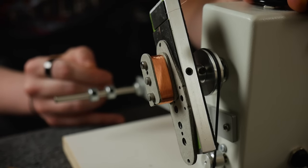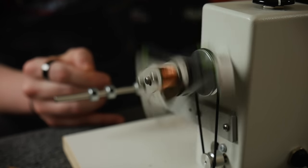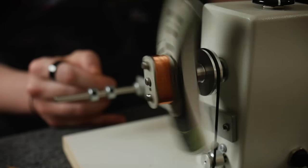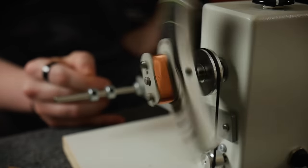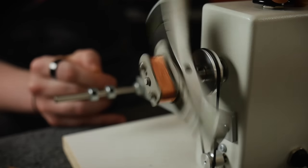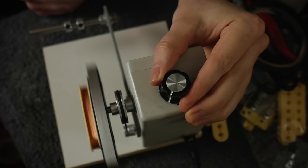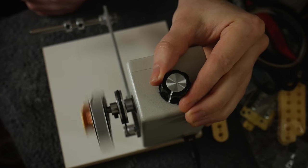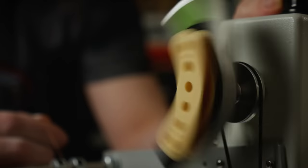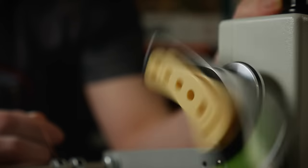There's a lot to be said for doing it the way that it used to be done, as it's those tiny, immeasurable inconsistencies that really resonate with people. When I'm winding pickups and I want different models to sound different, I'm not just changing the number of turns and magnet type in the design document — I'm also actively winding the coil differently. For one type of pickup I might try to wind the coil as evenly as possible; for another I may deliberately try to distribute the coil more in the centre at the beginning and then more towards the edges towards the end. I even draw little hand movement diagrams in my notepad to remind me how I should feed the wire. We've seen that the dimension of the coil changes the inductance and therefore changes the sound — this goes double for massively overwinding a coil. As we wind more and more copper onto the coil to achieve a higher DC resistance, we are also layering more and more to the lateral dimension of the coil. As resistance increases, so too does the inductance, but not in a linear fashion.